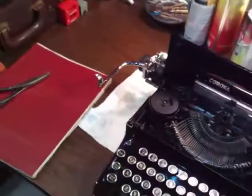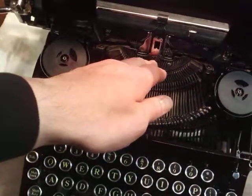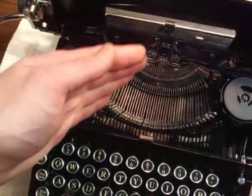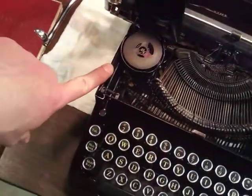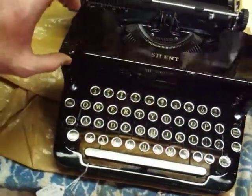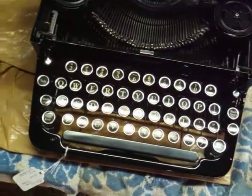Christmas is a great time. I updated this to the floating shift plate with the spring return. In the '34 it would have just been a regular plate without any insignia or spring return, with another plate behind it. I had to raise the A key up because it was lower than all the other ones — you do that with a type bar adjusting tool like this. You have no touch control here, which kind of sucks because it's a heavy touch on this thing. My other '34 has the touch control; this was the parts unit I built from.